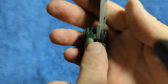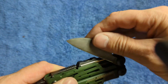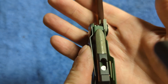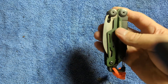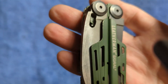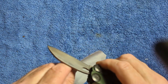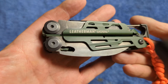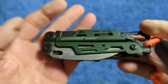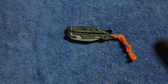The Signal is now finished. I took just a little bit more off the back of the blade so that the lockup is about where it should be — it was a little too early for my liking. So it holds closed nice, opens one-handed. Sharp. That's going to be it for this one — the custom blade and the scissors mod for the Leatherman Signal.